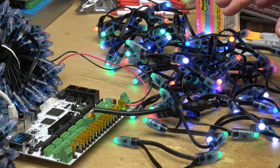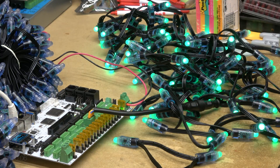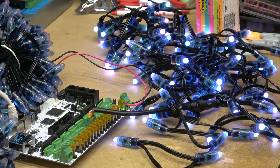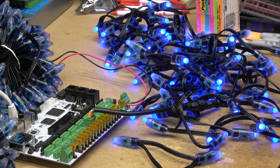I've got a bar pattern going across there right now. I've got a string connected up to the F-16 and then it just goes all white, all red, all green, all blue, and then another bar pattern. Basically what I'm looking for is just to make sure that all the pixels light up and they are the correct color. That will be the extent of the test. I will look at these a little bit more individually, but I won't make you watch me go through all this — this is basically what I do to test my strings. Once they're all working, that's pretty much it.